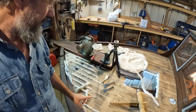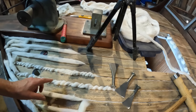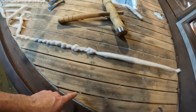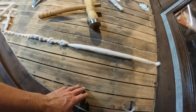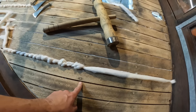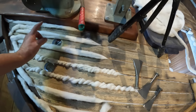We're getting to the end here. This is a good point to explain some of the techniques I'm trying to use. I am no master at this, but I've got a system going. Right here you can see a gap — that means I'm going to have to put extra cotton in here. Where it's nice and tight, I'm only putting a straight run of cotton. Just after this beam where there's a gap, I started to knot it up a little bit. Some of these have been good; some of these need to be knotted.